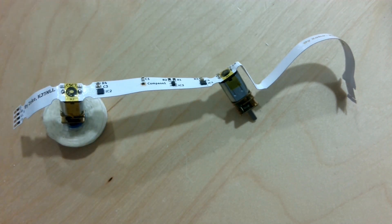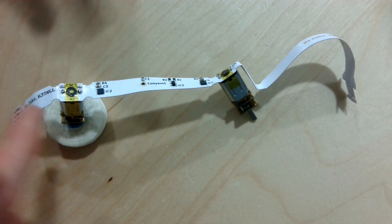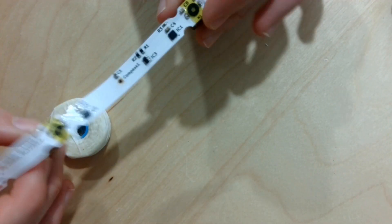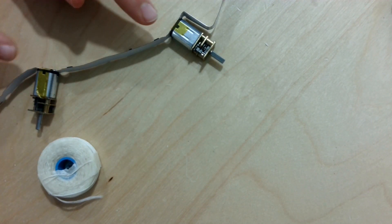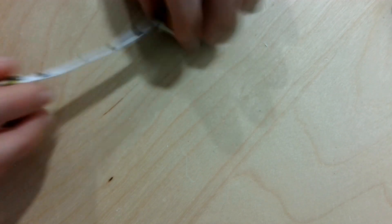As you can see here, this is what the flex board is supposed to look like with the motors attached. We have perfect solder joints, and the reason the solder joints did not come out is because of the coverlay and the wide copper pours. We're able to bend it in all sorts of crazy ways and have all of our components on there. It's really cool that you're able to directly solder motors onto the flexible PCB and have it work.